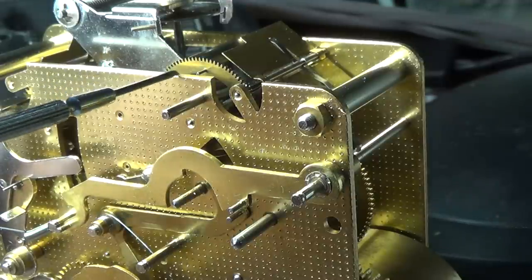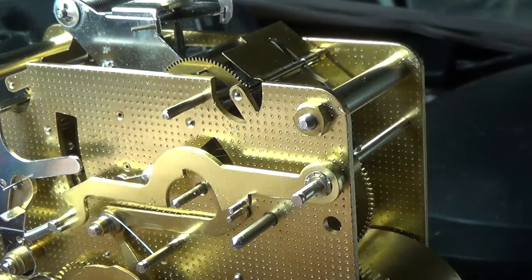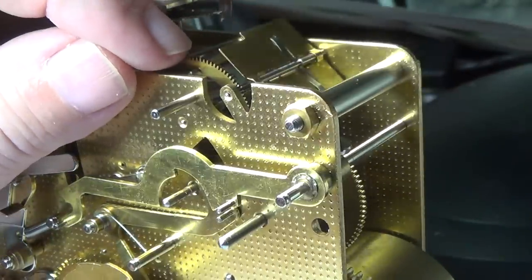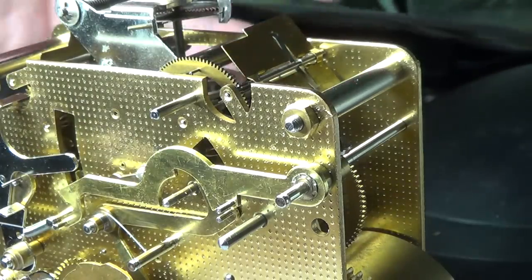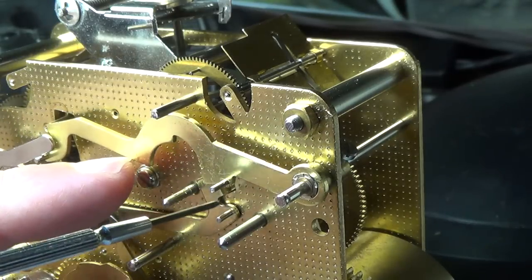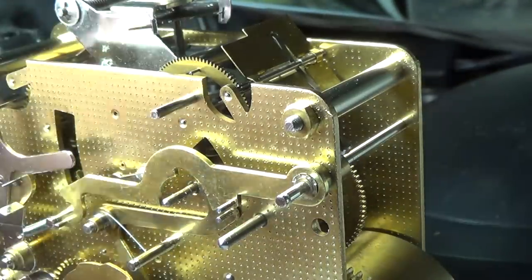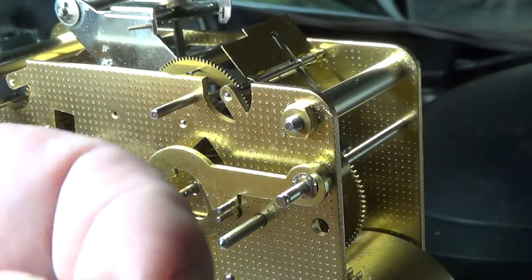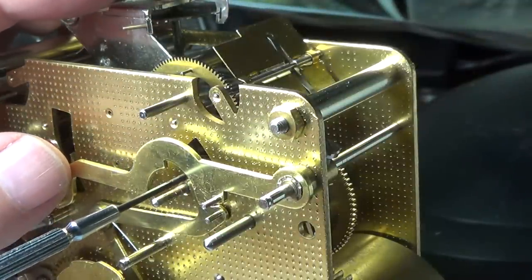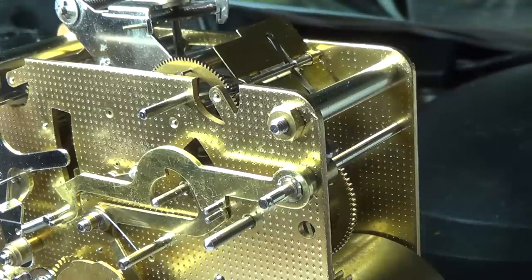It is not a pin on a wheel inside there. And so you got to make sure that, first of all, setting this up, that the pin on the warning wheel is at top. Give it enough movement, because the lever that catches it is inside at this point right here. And so we need to have it rotate enough that the pin on this cam can be released from this notch as this is being lifted, that pin will rotate enough that it can't just lock it immediately.